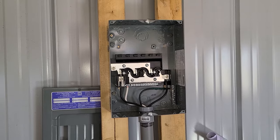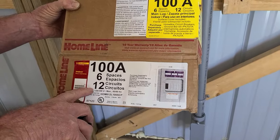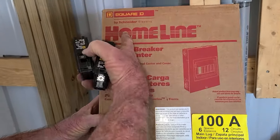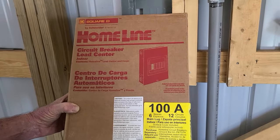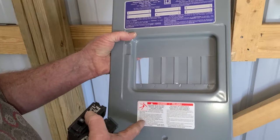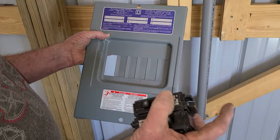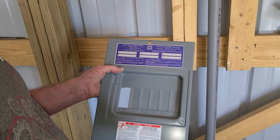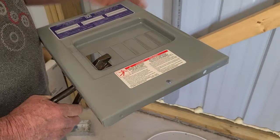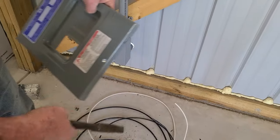Next step is installing the breaker. This is a circuit breaker load center with six spaces for a maximum of 12 circuits. You need to make sure your breakers are compatible — these are Square D Homeline breakers, which are a really good brand for virtually any residential or light commercial application. We'll have them linked in the description below. The covers of service panels or sub panels always come with at least one knockout. I'm going to put in two breakers temporarily since we don't have any branch circuits to install yet. Use your lineman's pliers to break out one more opening — just twist it and it comes out easy.